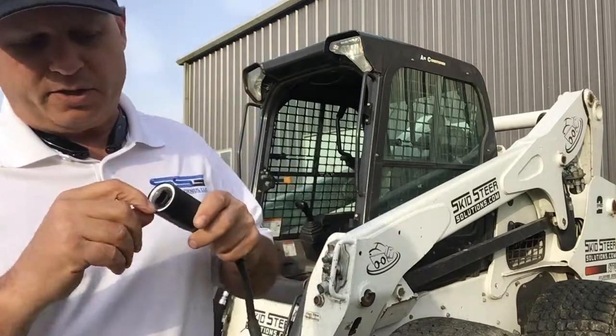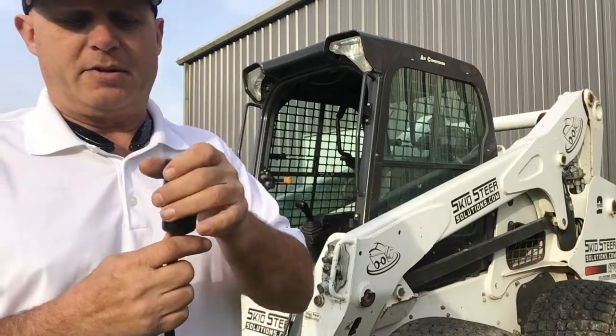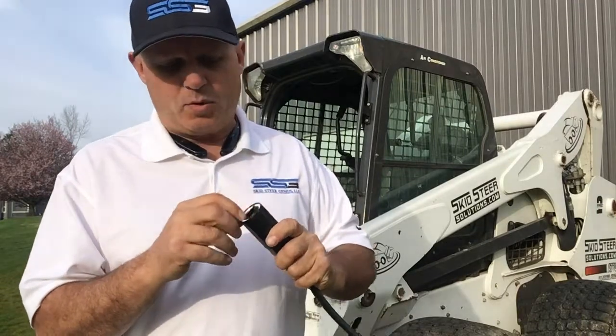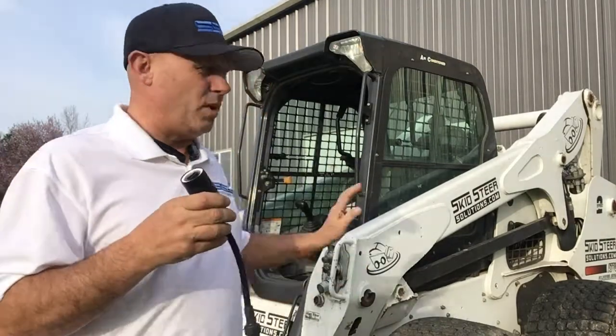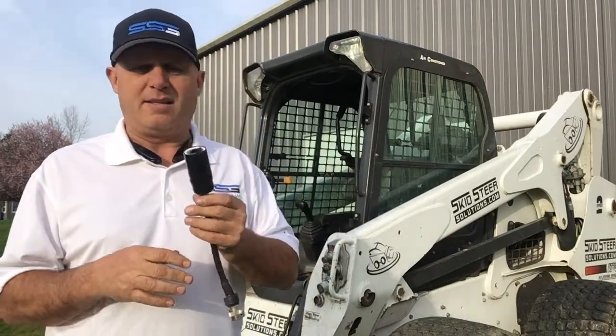The controller components have been placed in their containers and submersed in potting compound. The top quarter-inch section is clear compound. The reason we did that is we buried an LED in there — this is your status LED. It tells you if it's working and what's going on inside your machine. It's one of our genius products that has been very popular.